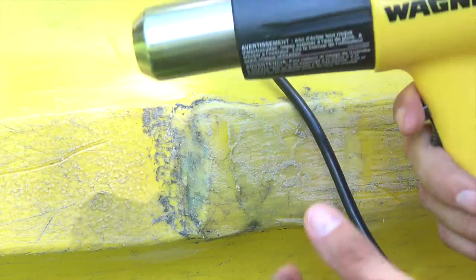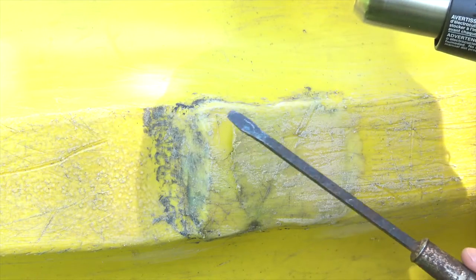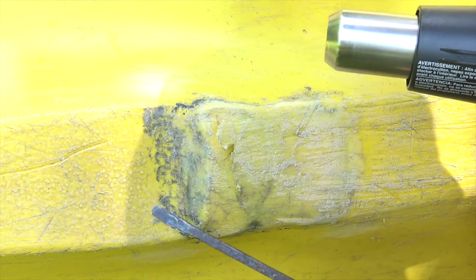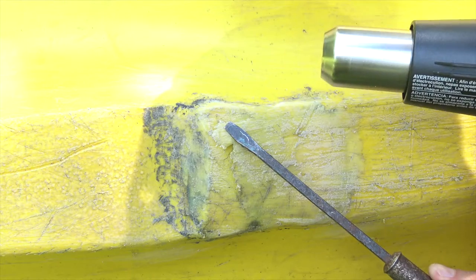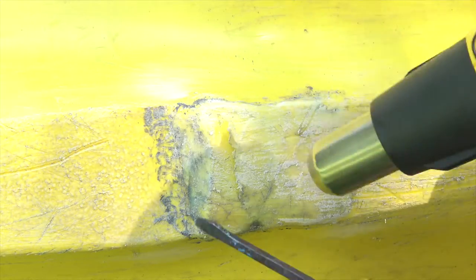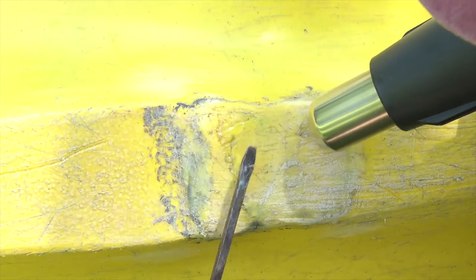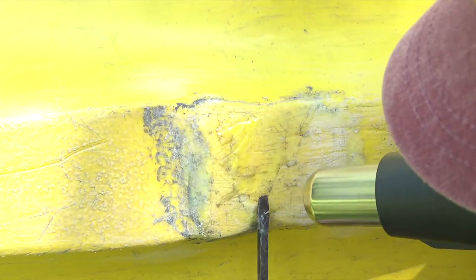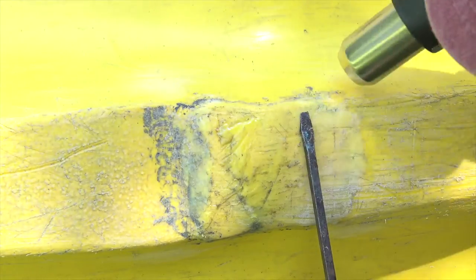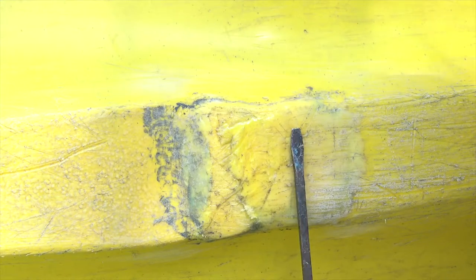What we're going to do now is take the heat gun and see if I can smooth out some of this already preformed stuff. I'm going to use the heat gun and the screwdriver to basically push down things and remold that plastic, and then I'll be adding the extra plastic over the top. You always want to heat up the area where you're going to put the patch first, then heat up the patch, and then put it on.